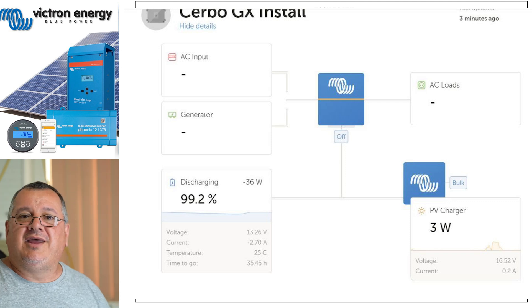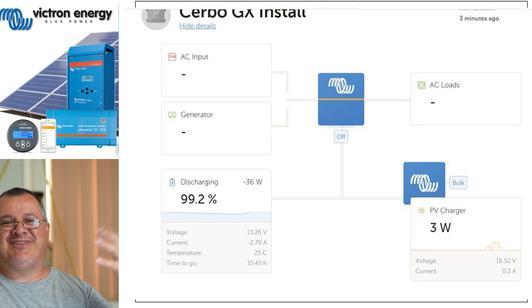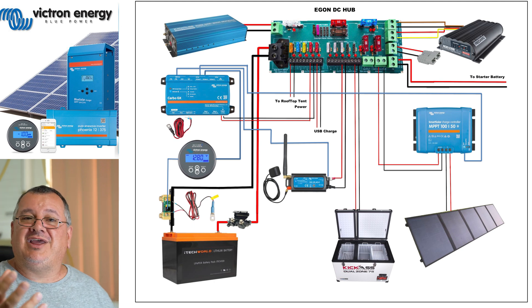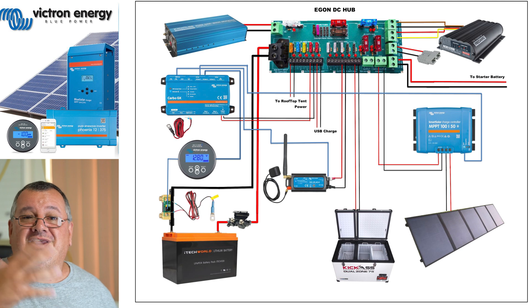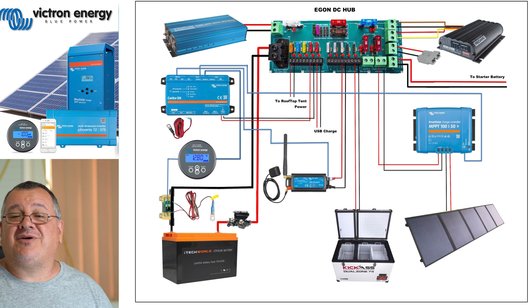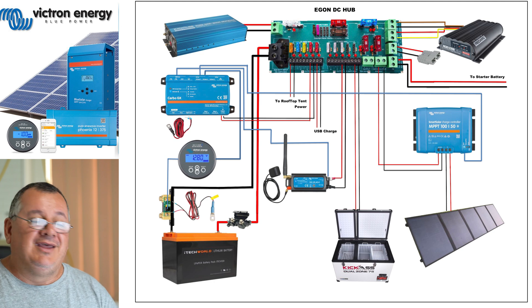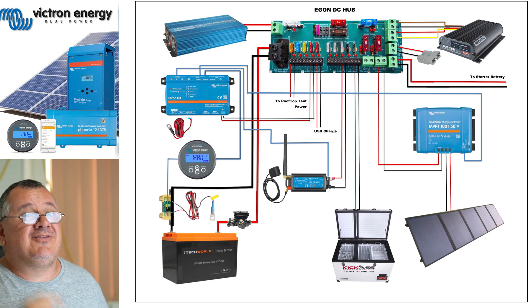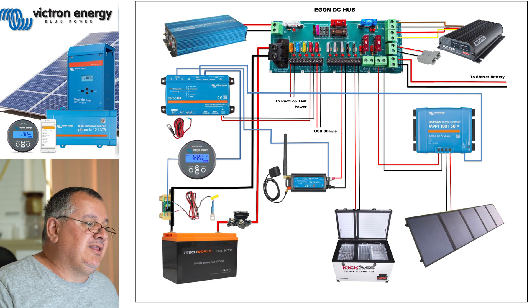It'll allow this graph to work and save all that data and upload it to the portal - more information, which I love. I might also pick up a smaller MPPT solar regulator so I can use it with my 12 volt solar blanket for additional power. It's very small and packs up small - I've got a small solar blanket I can put over the windscreen. That will then show two solar panels with correct information from each one. Those small Victron MPPT solar regulators for a 12 volt system don't cost much at all, so I should invest in one.